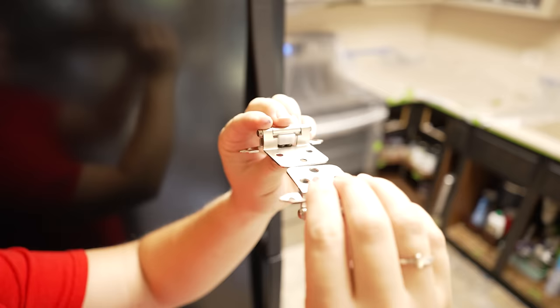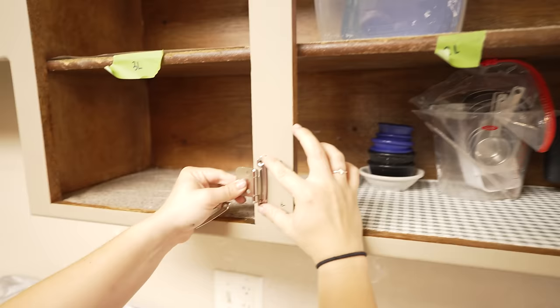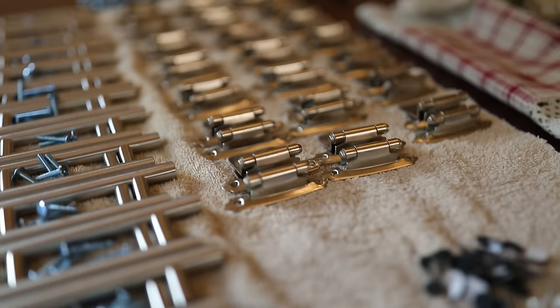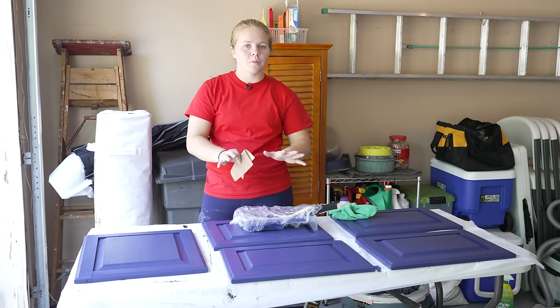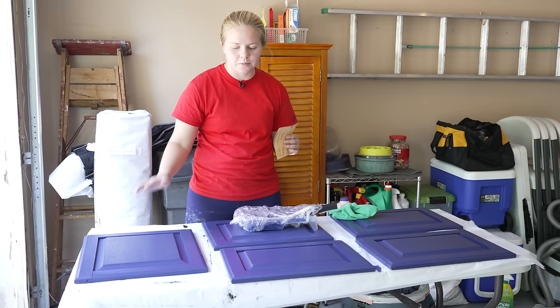I decided to head to Lowe's and talked with the owner, and we ended up buying some new hinges so that we can replace the old brass ones that are very dirty and replace them with brushed nickel, which will also match the hardware pulls that we picked out. We're on to the last coat of the navy — it's going to be on the outsides of the cabinet doors. Just like I did on the inside framework in the bathroom, I am going to sand down lightly with my 400 grit sandpaper between coats to give it that really smooth finish.